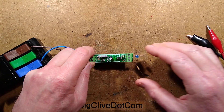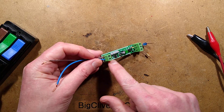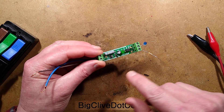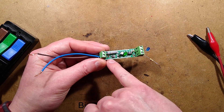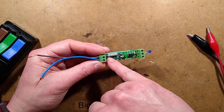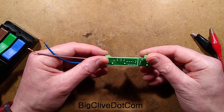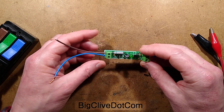Things worthy of note: the mains voltage side of this is referenced to mains - you could get a shock off it. It is fully isolated and they've done the proper gap here - they've drawn a white box around it marked high voltage, which is quite sensibly designed. However, the little mounting holes in the circuit board aren't great - this one has a fold where the resistor could actually short against it and go through the insulation. This is a common thing when they miniaturize circuit boards - they don't think about mounting, so you'd need quite small screws.